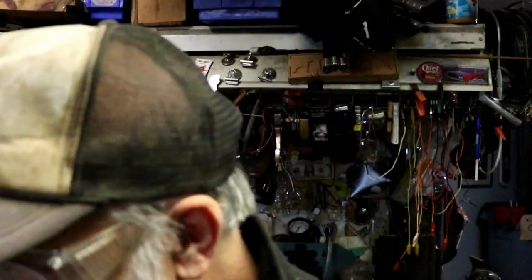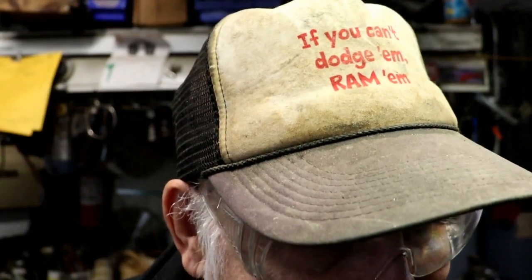I don't know what to say about the NC machine. It screwed up on me once, and I don't know why. It'll do that every now and then. You don't know when. If you knew when, you'd know what it is. If I knew what it was, I could fix it. But I don't know what it is. I put soft limits on, I got the hard limit and then a soft limit in between. Same thing with Y-axis. The only one I haven't done that to is Z-axis.